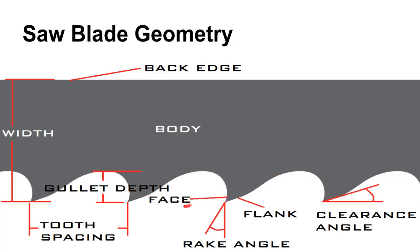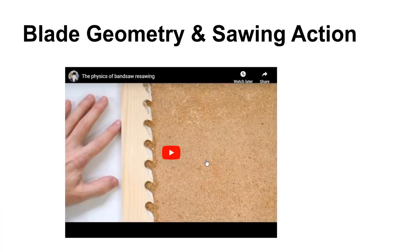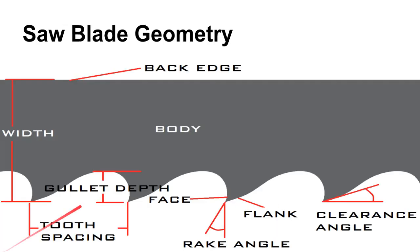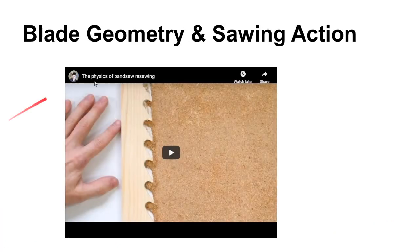The flank is the backside and falls out of the way to give clearance so that you don't have metal-on-metal rubbing. The clearance on the flank side moves the saw out of the way so there's clearance between the blade and the newly cut material, and then by the time it gets to the second tooth, it can cut some more. What happens inside the gullet is that material comes in and accumulates — with a nice ductile material, it will curl up into the gullet. The gullet is the place where the chip accumulates, since the cutting is happening down inside the metal.